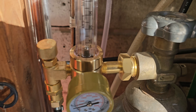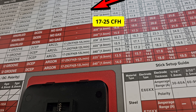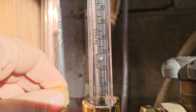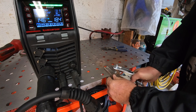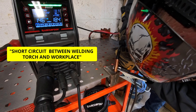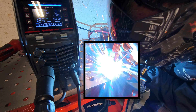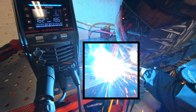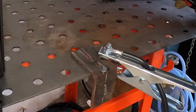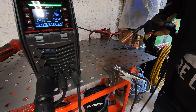We push this button so we can adjust the regulator. Oh boy, I'm running low - flow is supposed to be about 25. Let's clean up this piece of steel, still a little dirty. You can see it tells you when they're just short. Gotta turn the gas on! That's more like it - a little better when you turn the gas on than when it's not on.